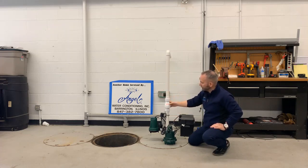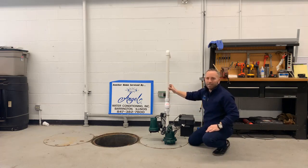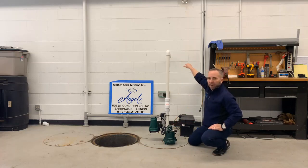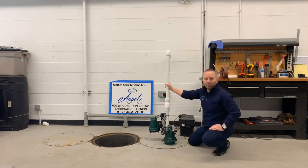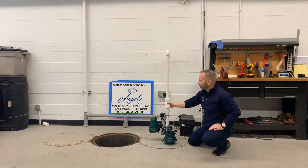As water goes up through the pipe, there's a one-way quiet check valve. This causes a lot of customer concern — they hear thumping at night, and it's almost always the check valve. Cheap metal ones are about $10 and cause a lot of hammering and wake people up. We recommend a quiet check valve, which has a spring so when the pump flushes 35 gallons a minute the flapper opens, and the spring slowly lets it back down without hammering. That vibration is what makes the booming noise people hear at night.